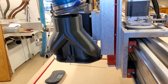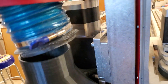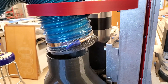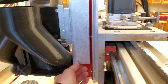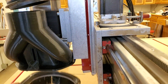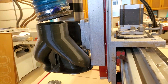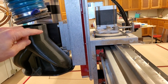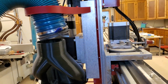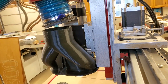I'm going to start with what it took to mount this boot turned 90 degrees, or almost 90. Because of the tramming plate I have with both sides sticking out, I clearanced right there. This is as high as it would go, which was just enough to work with a typical bit and the brush length, but it took away some of the adjustability for going higher. I actually had to redo my tramming plate setup — it was originally higher up and this wouldn't go on at all — so I had to lower the tramming plate on the Z axis and re-square everything, which I had just finished doing, of course.